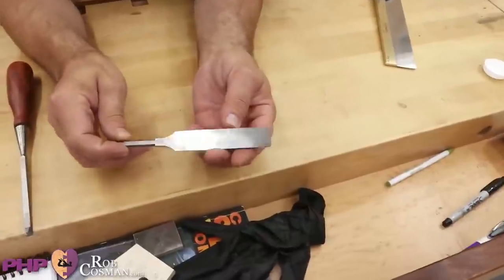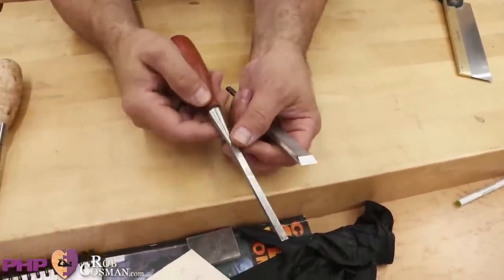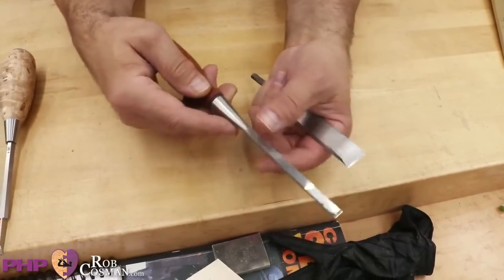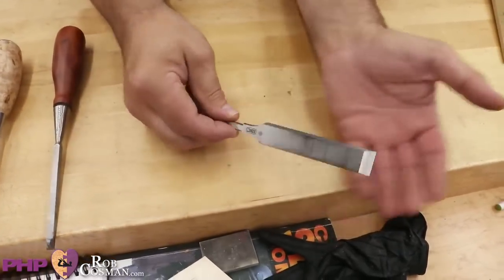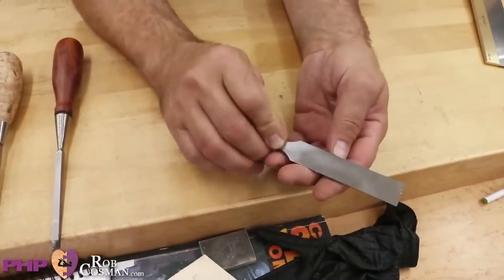You're going to want to do that yourself. So when you prepare the backs, you want them to sit nice and flat. All the other chisels have some kind of a ferrule or cone on here that'll end up touching the stone, and that screws up the process if you're not careful. On the IBC, you can take the chisel handles off, and that lays perfectly flat on the stone. Nothing gets in your way, so really easy to do.